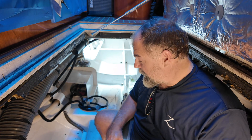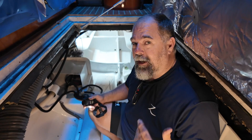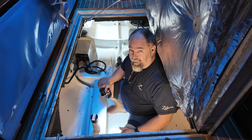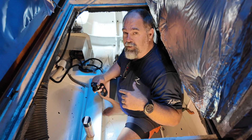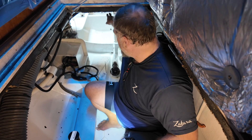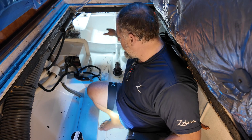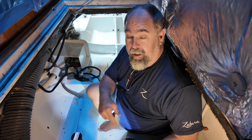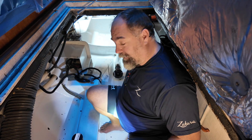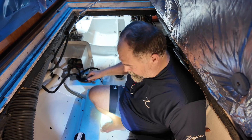Just Catamarans has done a great job so far. I haven't had any complaints. When they get on it, they get on it. I think the Yanmars are actually going to be a little skinnier, so I can get down on the sides of the engines better. The other thing I've done on the Yanmars — we'll show you once they're fully installed — the fuel filter and the oil filter are going to be remote filters back here in the sugar scoop. So I can literally service the entire engine from back there without, except for changing belts and an impeller, fill it up with oil from back there without ever having to come in here and touch the engine. So that's the positives.